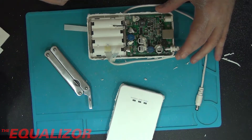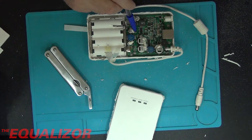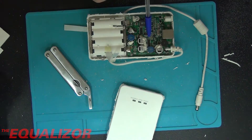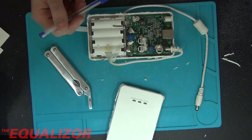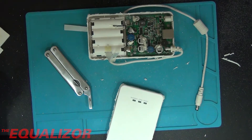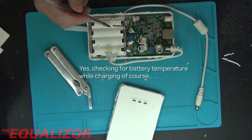I might hook it up to my power supply and just see what it outputs. I don't think there's any point getting too much into the electronics, but I can see a MOSFET there, and a couple more MOSFETs as well. There's a little buzzer - I'm guessing that's if power goes or something. There's a little fuse down there, and up here that looks like a thermistor, so I'm guessing it's checking if the battery's getting too hot.